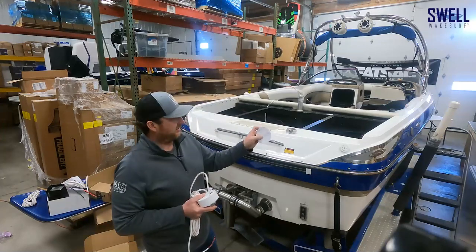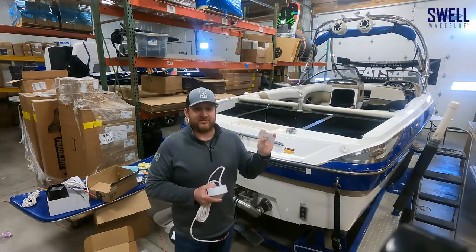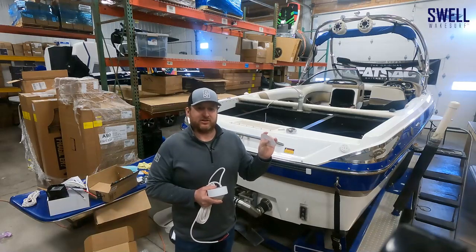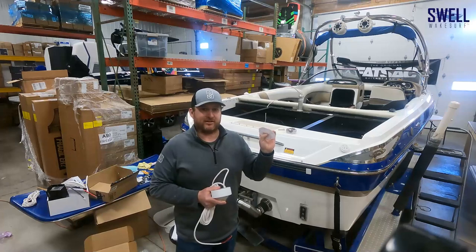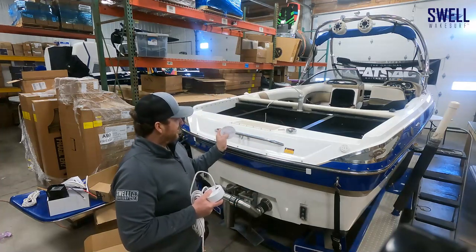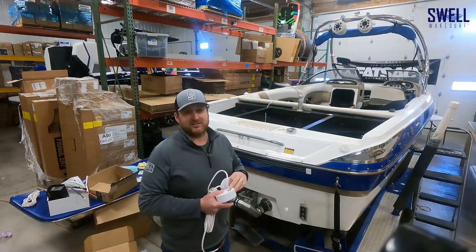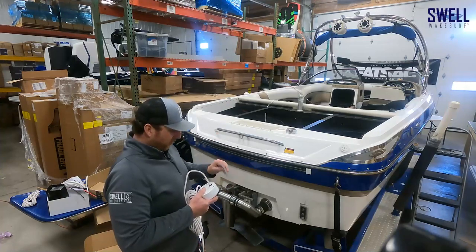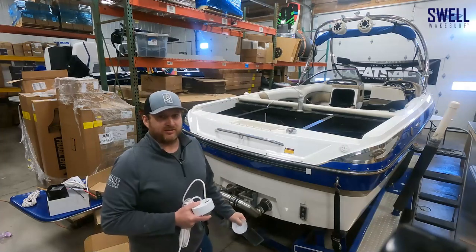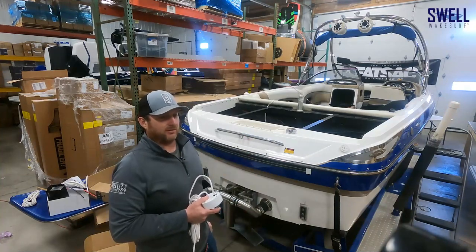Liquid Lumens sends you these templates. You need an 11/64 drill bit and a half-inch drill bit. These stainless steel screws are fairly sensitive to breaking — instead of twisting like a normal screw, these snap off. So make sure to use the correct size drill bits. We're going to get these templates in the area, clean off the hull, and make sure everything's clean because we're going to be gluing these on with 4200 as well. We'll be taping these templates on, drilling our holes, getting these mounted, and then Jake will finish up wiring everything to the battery and to the Liquid Lumens control box to get these RGBW underwater lights wrapped up.